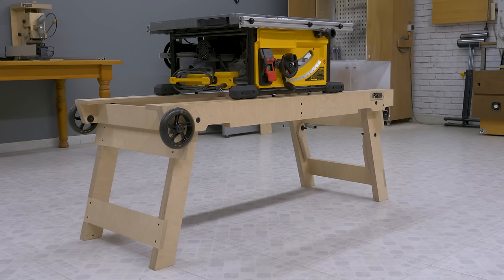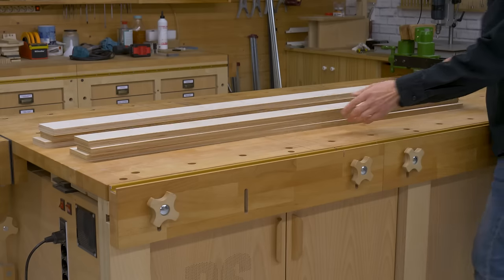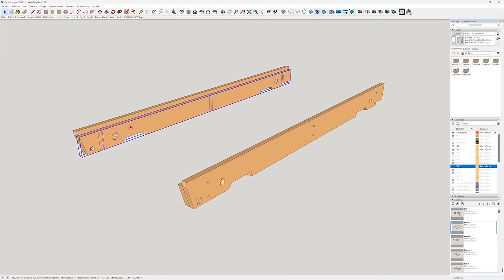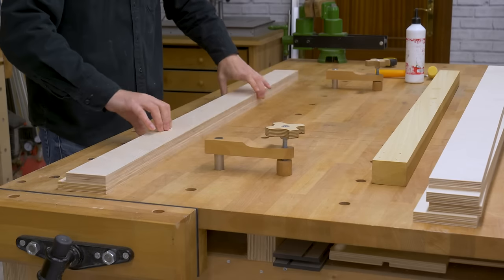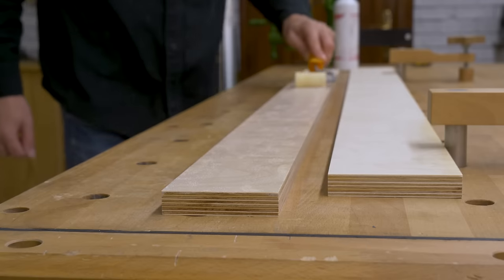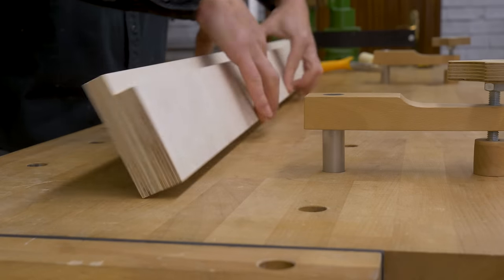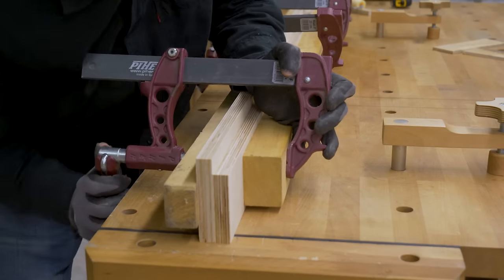Now I'll show you how to make this foldable bench. I've had most of the required materials cut to size at the same place where I bought the board, in order to speed up the building process. I'll try to make the rest of the required cuts on the bench saw itself. I'll start by gluing together the parts required to make the frame rails. I'll use some stops to position the parts, wood glue, and nails to stop the parts from moving when applying pressure with clamps. I'll try to place the nails in places where I won't have to drill holes or make cuts. I'll also use a previously flattened wood strip as a ruler while the glue is drying to ensure the rails are straight.